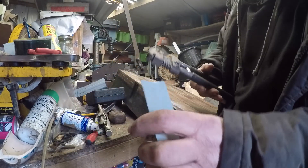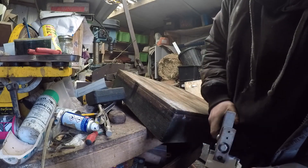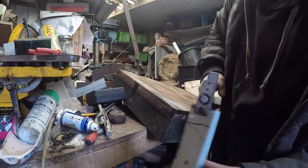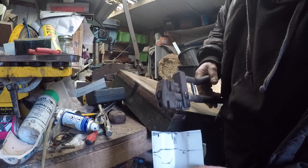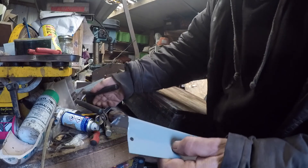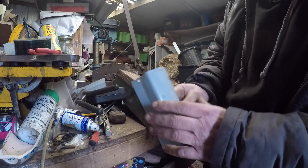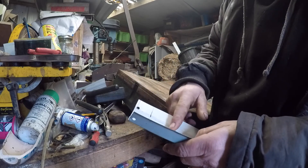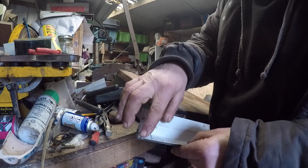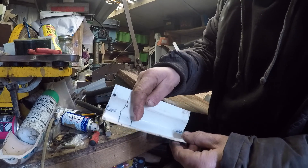The way I normally do these is just put a little hole in here with a punch. It's a lot easier to punch this stuff than it is to drill it. It's very thin steel but with a good galvanising coat it lasts for 20 to 30 years, maybe more, so you can easily punch holes in it like that. If you're drilling it with a drilling machine you must be absolutely certain to clamp it down, otherwise it can tend to spin when the drill goes through, and if your hand's in the way it will cut your hand very badly.